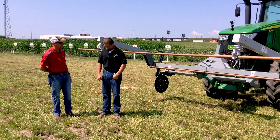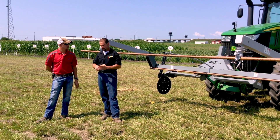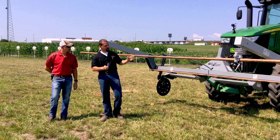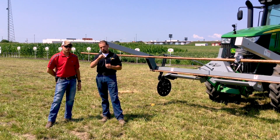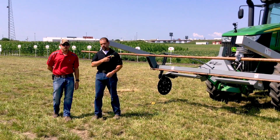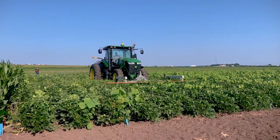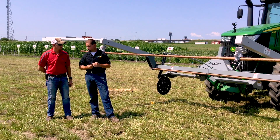So let's talk about the Weed Zapper — development, how it works. Basically, we're sending a positive charge of electricity down the stem of that plant. I like to use an ink pen as an example: the center point of your ink pen represents the moisture inside the stem of that plant. We come across with the electrode and touch the stem. That energy transfers down through the inside of the stem all the way into the root system, travels across the earth and back to the grounding coulters, completing the circuit back to the generator. Whenever we have that connection between positive and negative electricity within the moisture of that stem, it causes rapid or even instantaneous heating, which causes cell damage or cell explosion — and the plant is obviously dead.